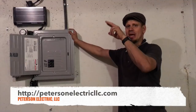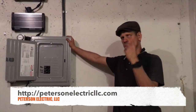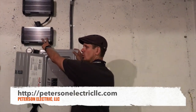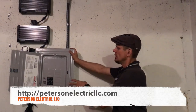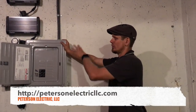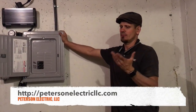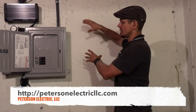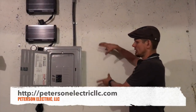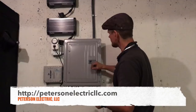At 230 or 220 volts you're closer to 17 to 18.5 amps. The lower the voltage, the higher the ampacity — that was the question he asked me: should we go 120 or reorder cords from the ballast? Running at 240 is better because you're doing less ampacity. Right now with the contactor and lights running efficiently, I bet we're at about 15 amps, so we could definitely add four more lights on this same wire with a 60-amp breaker.